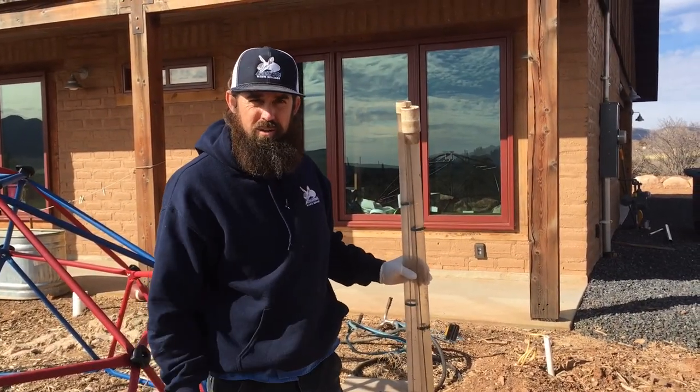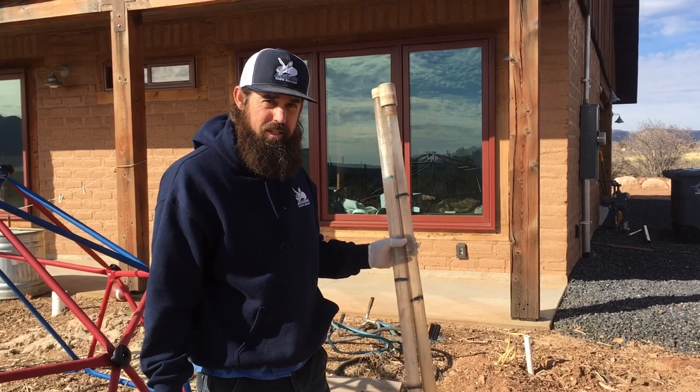Go wash the sock so your husband doesn't know you used it to check the septic tank. My recommendation: as we saw, we have about six inches on top and six inches on the bottom. The stuff on top was thickest right around the inlet tee — further back it's more like four inches — so this tank is about halfway there. Definitely going to wait on pumping it. It's good and healthy, didn't smell like rotten eggs, nice brown crust. This is about a two-year-old system with a family of six, so it'll probably need to be pumped in another two years.